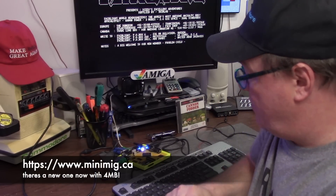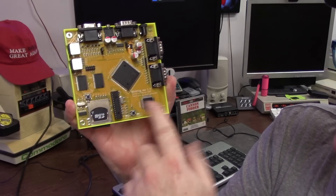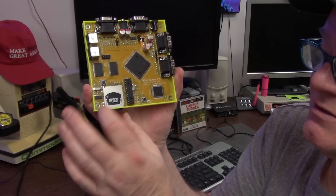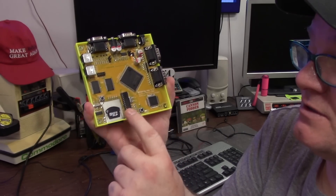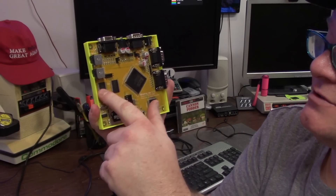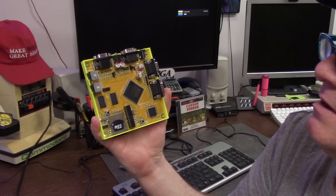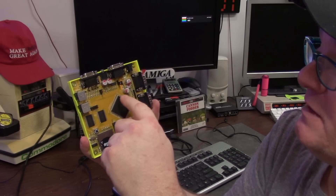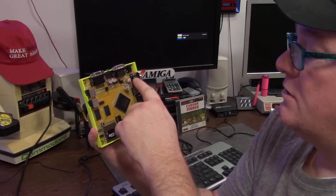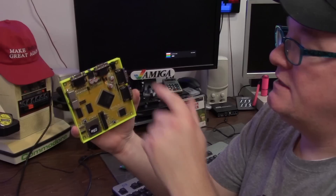Here's what she looks like all close up. Here's your reset, the F12 program button, menu, your micro SD. The only thing I hate is it doesn't grip very well — even though it clicks, you can just slide it out. Very inexpensive part use, so make sure you're snugged in there. Here is your Xilinx Spartan, the 68000 is right here, here's the memory. There's no way this is only 2MB of RAM — it says expansion header or spare IO. 31 or 15 kHz jumper, FPGA or MCU jumper, and a Xilinx program JTAG port. Joystick, mouse, RGB, VGA, PS2 keyboard and mouse, and power.